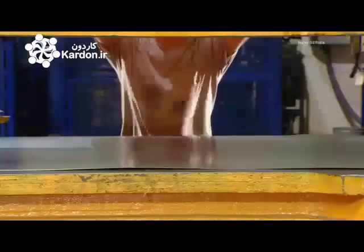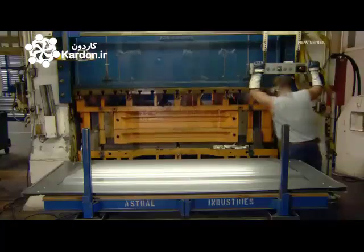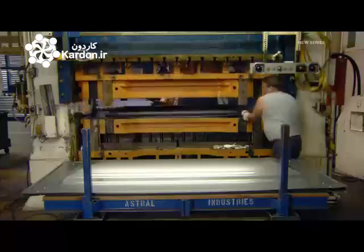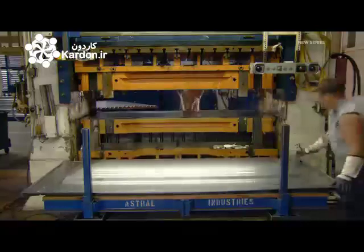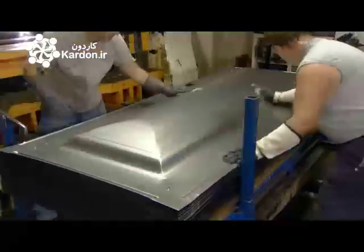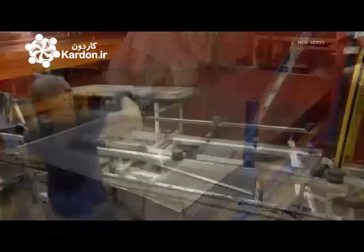This factory makes metal coffins constructed from sheets of steel. To form the top, workers insert a sheet into a press. A die inside draws the metal into a panelled shape, requiring 900 tonnes of pulling force.